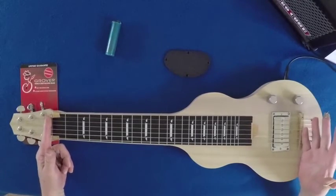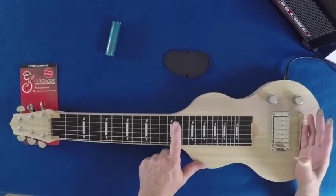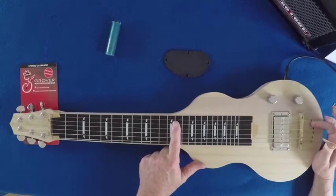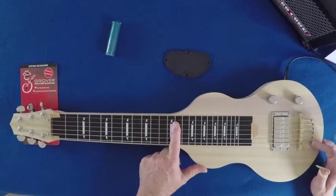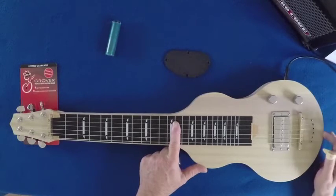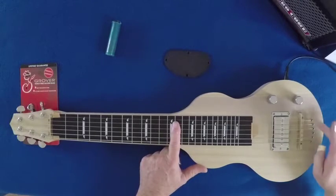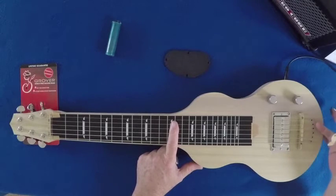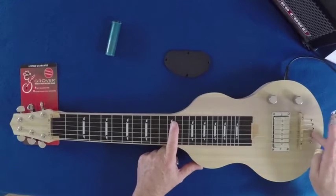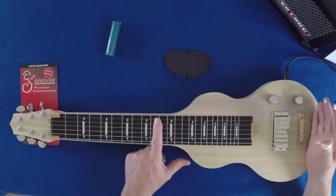These will come already set for a 23 scale, and this is a 23 scale fretboard. Now, on the deluxe packages like this one, I already drilled the string throughs. And what we did here is I just pressed these ferrules in with my fingers. So if you're going to paint it, then you want to pry those back up. You can use a putty knife or whatever, razor blade, and get those out so that when you do your paint job or what have you, those will be out.